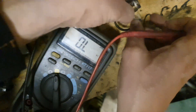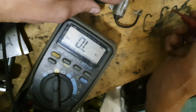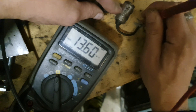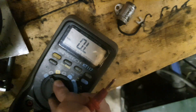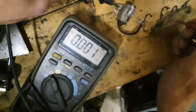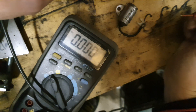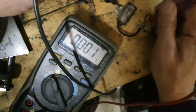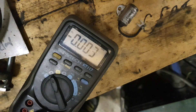Let's try and charge that up again — I don't think that charged correctly that time. So we'll ground that there. Okay, it's now charging correctly. Then we go to volts, and this time we'll stop at about 0.2. We'll leave that there and check that it starts from where it finished off last time — which it does. And that means that condenser is good.